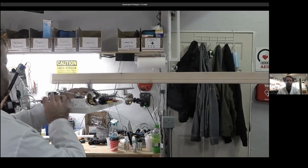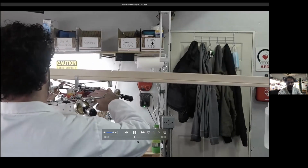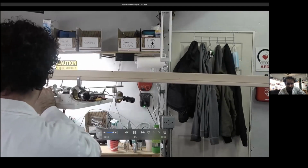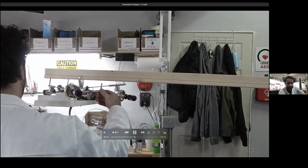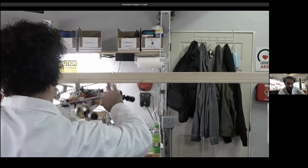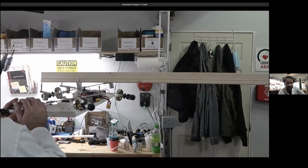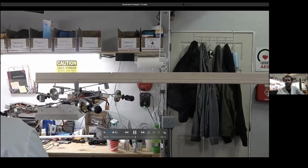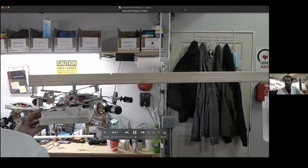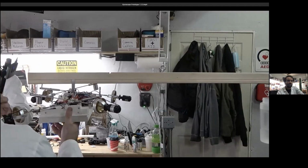I want to get this set up with a little bit better motors, a little bit better coordination, and maybe a little bit bigger spacing so they're not hitting each other. Yeah, we definitely need to rethink this experiment. We actually have parts coming in tomorrow, stronger servos, and we picked up some aluminum bracket that we're going to be using to attach to the gyroscopes instead of these little spindly arms that it came with. They're not strong enough to hold the device, but we have seen some movement over here, so it is very promising. Damn it, Mark, I told you not to get into the controls. We're going to be moving forward on this experiment for sure.